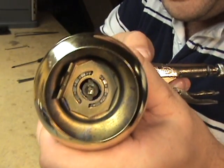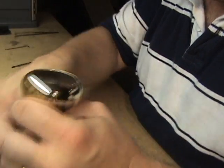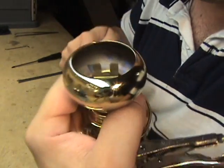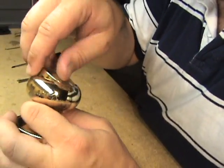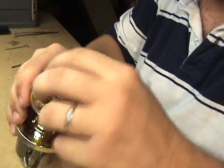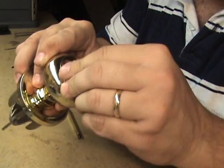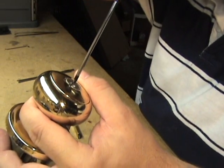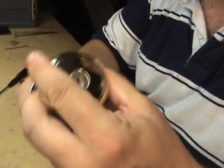There's the spindle you're pulling out of the way. Turn it to 4 o'clock, pull it out, you're done. Re-key it, put it back in. There's a little notch out of this one too for the bible. Stick this one back in, then turn it back up to 12 o'clock to lock it into place. Take your vise grips off and you're done. That's the Weiser.